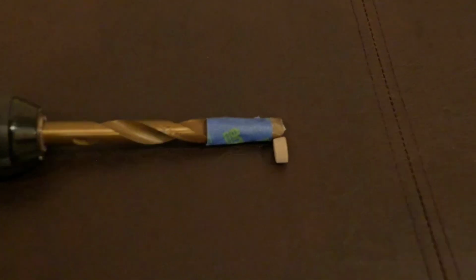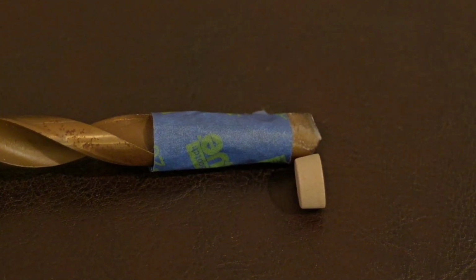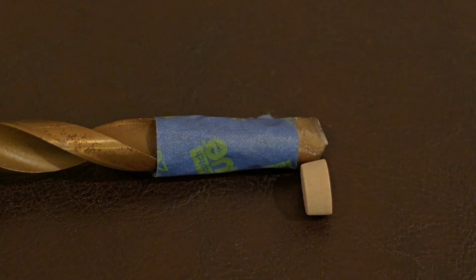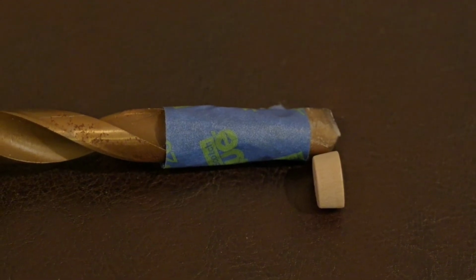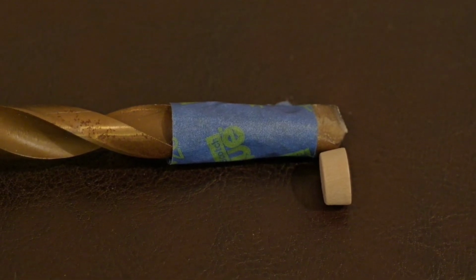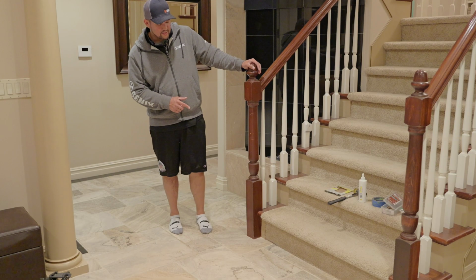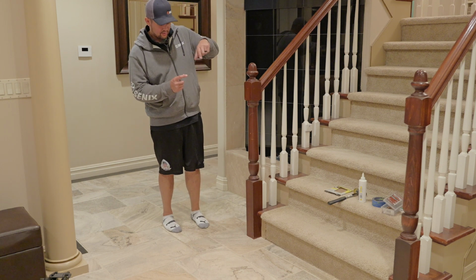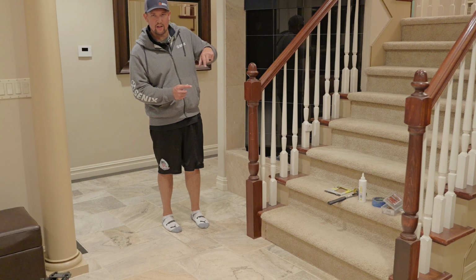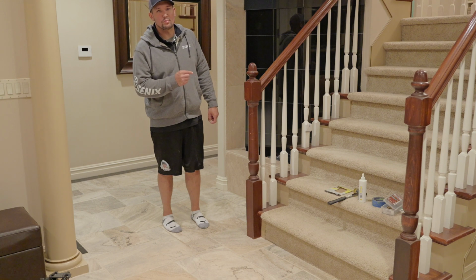If you look over here, the drill bit, this is the 1/2 inch. I'm taking the painter's tape and going up against the flathead plug and just eyeballing how far I have to drill in and making a tape mark the same size as the plug. So what we're gonna do now is, this thing is basically centered, so in between the 4 holes that you saw there, I'm gonna drill one right in the center up to the painter's tape. That way we have our big hole for our plug.